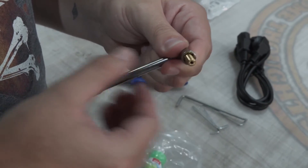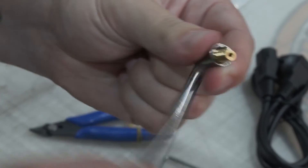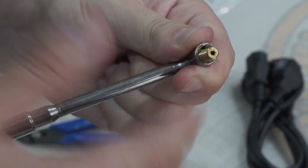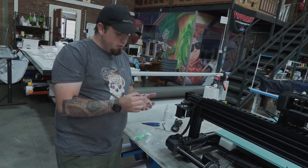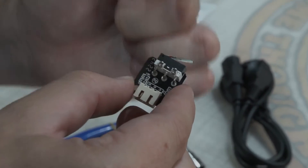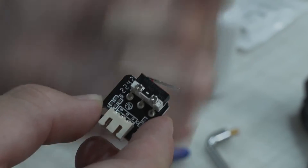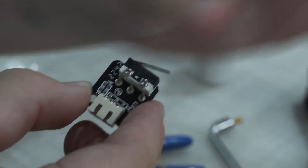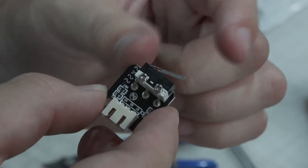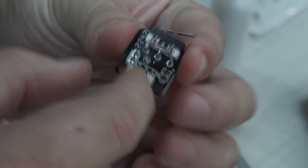It's always nice to be able to use this tool — you just slide it over the head just like that and then you can unscrew the nozzle from the print head. We also get a micro switch, which is basically going to stop the gantry from moving — it's a limit switch. There is more than one located on your printer that stops the gantry from moving, and it also acts as a reset button, so it's nice to have in case you damage the system.